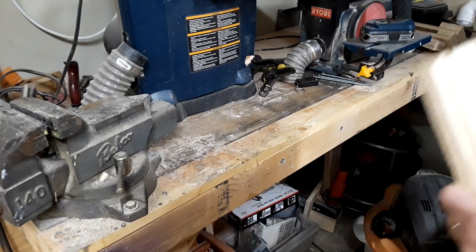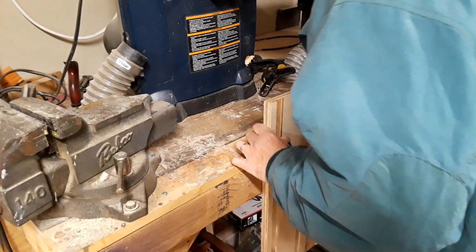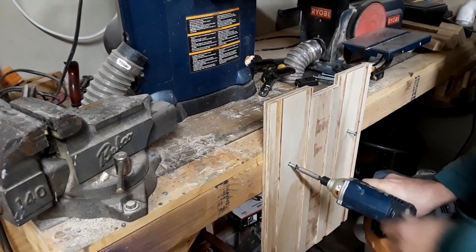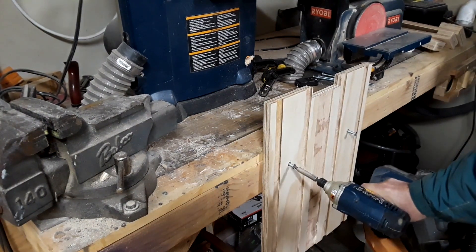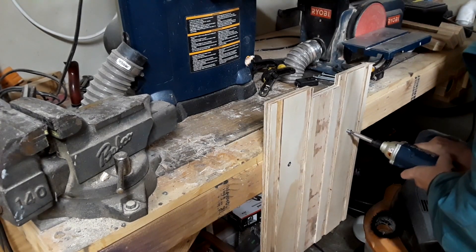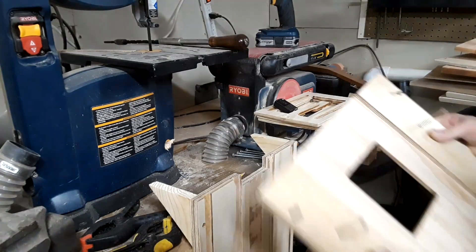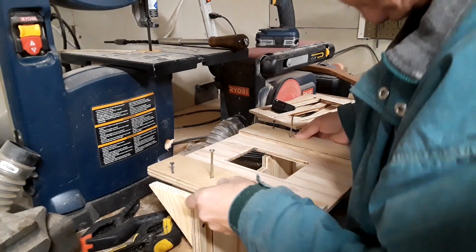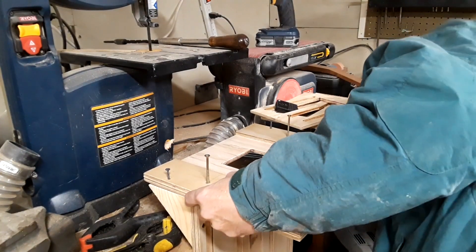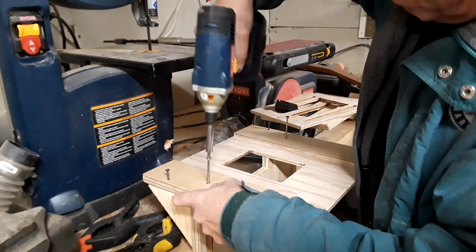I need to mount my jig to the side of one of my workbenches and it needs to be easily mounted and unmounted. The block and dowel set on top of the workbench to line up the two threaded inserts to securely mount the jig onto the side of the workbench. 90-degree gussets are attached and they need to be very accurate, so take care there. The table top, or top board, is a 3/4-inch piece of plywood cut 12 inches by 14 inches with a 4-inch by 7-inch hole cut near the middle of it.